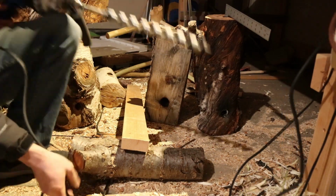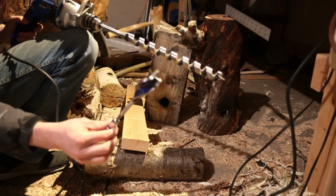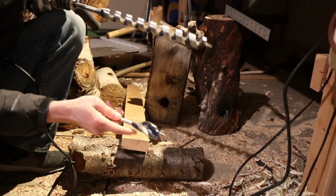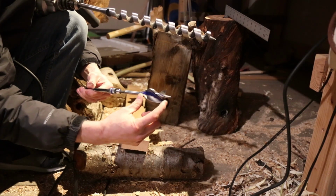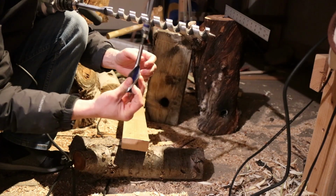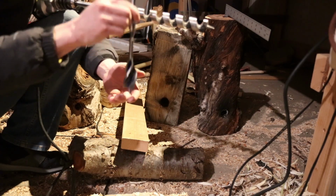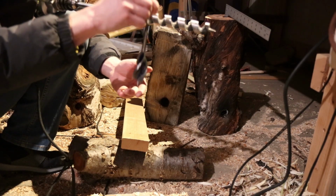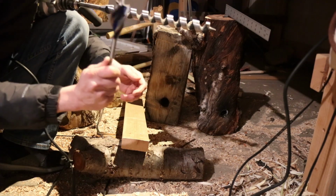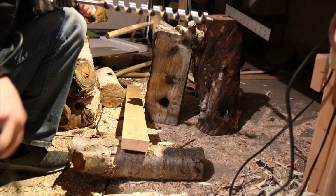All right, pause, super fast time lapse. I'm gonna switch this bit out and go with my 1.25 inch. This one I don't really like. It drills faster, but because of the narrowness, I wanna say shortness of the flutes here, this bit has a bigger tendency to go in and wobble on the angle and create somewhat not only of a crooked cut, but also on the exit, it can tilt to one side, and trying to pull this out when it's tilted, it's a backbreaker. But it does go really quickly, as you'll see. Well, everything's gonna go quickly for you, so resume super fast time lapse.